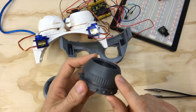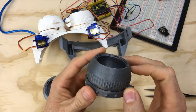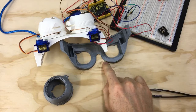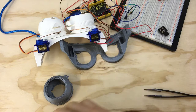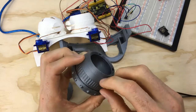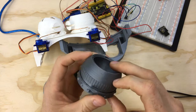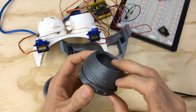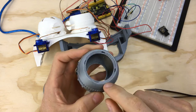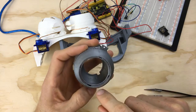A couple comments on the live stream noted these prints look terrible, and I completely agree. This one had the temperature too high and it was blobbing — the prints are okay, just covered in zits. On this one the layers look like they're all misaligned or something.